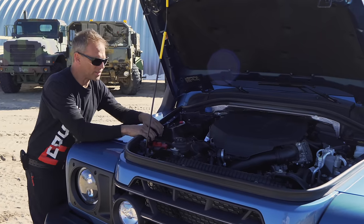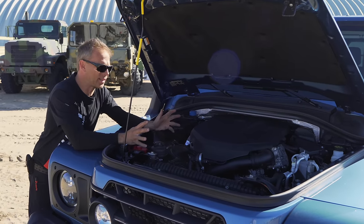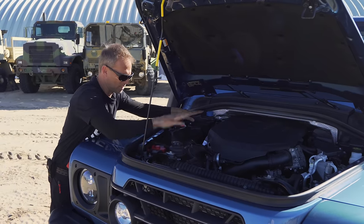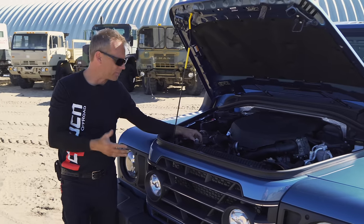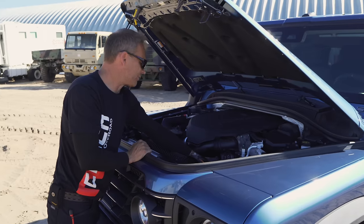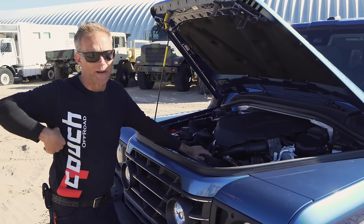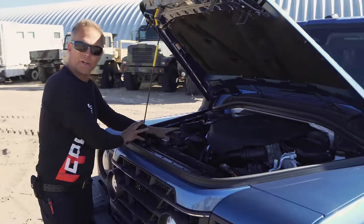The engine layout is trick. Compared to the Jeep, Toyota, or almost anything else, I could touch almost everything on this engine from underneath. I could grab the entire turbo assembly — starters are directly on the bottom with a cool casting that unbolts and comes off. I've got two coolant reservoirs, a power steering reservoir, and quite a few radiators stacked up in this thing. We'll see how that pans out with dusty debris and weeds. The alternator is right on top, just like what I'd see in Africa on the cool Fords over there. The air compressor for the A/C is right below that.